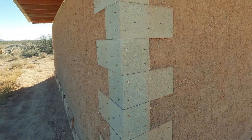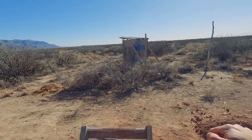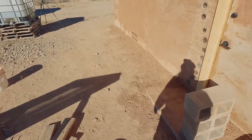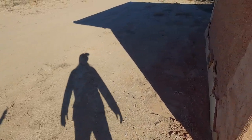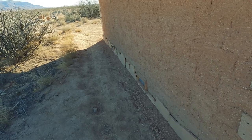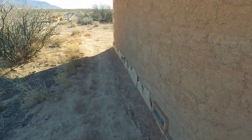It's an absolutely beautiful day for earthworks — mid-50s, and when the wind dies down it feels like the 60s. Welcome to January in southern New Mexico. The foundation is a rubble trench foundation. I dug the trench, filled it with river rock and gravel, and on top of that there's a concrete stem wall 8 inches above grade. Generally speaking, you want to avoid putting earth directly on grade — any moisture resting on the ground can soak into the wall and damage it. You want a concrete, stone, or waterproof stem wall for the earth to sit on. This concrete is a continuous rebar-reinforced pour.